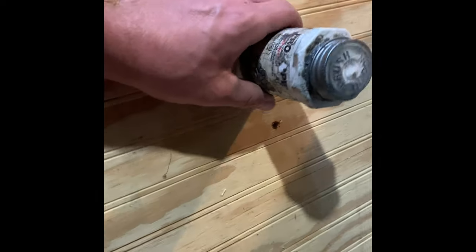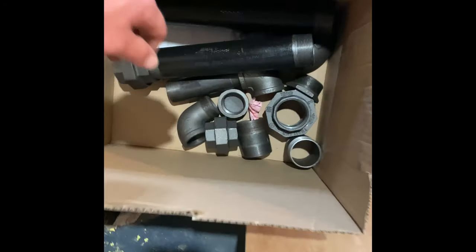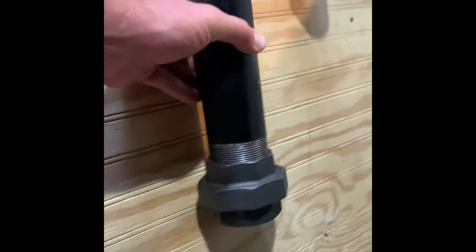I just got back from the store. Now, the hardware store. If you're going to do the plumbing on your oil tanks, what you want is this non-Teflon. It's hard to see brand and everything, but you want something without Teflon in it, because for oil furnaces, Teflon will destroy them.